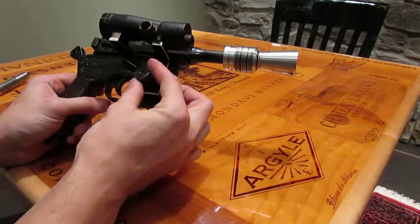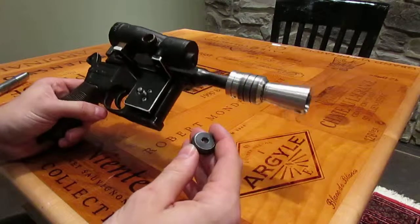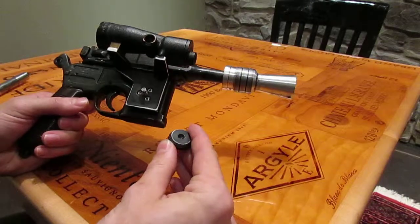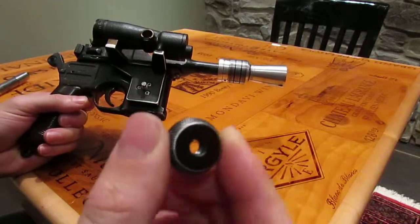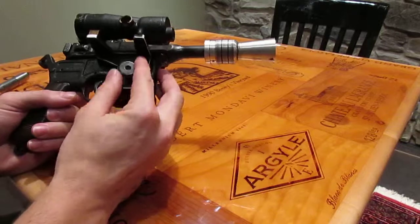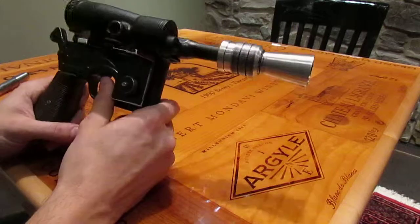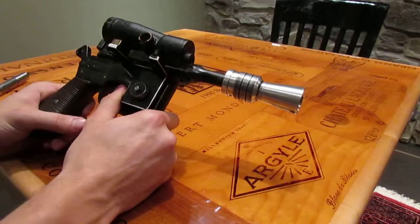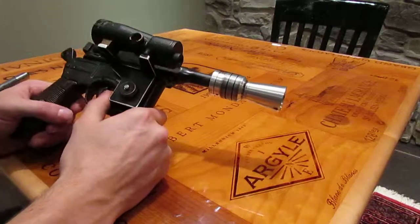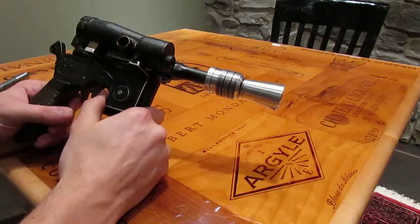Nice powder coated thing here. This is the only thing on the whole gun that I'm not happy with, and we talked about it, and there's not really anything I can do because I tried it several times, and it was no problem for me to try several times, but apparently if you try to knurl a taper, you just get this weird spiraled pattern. I'm not sure how Scott Jua was able to do it. I talked to him about it, and he said he didn't have any problems doing it, but I tried it quite a few times, and it's just the geometry of the taper is what causes that spiral, and there's not really anything you can do to prevent it.